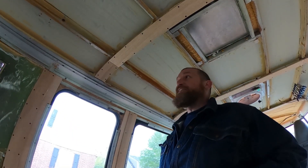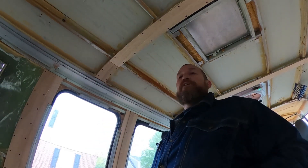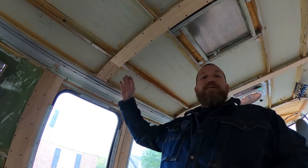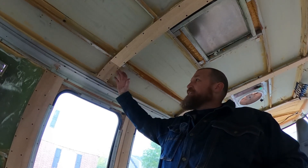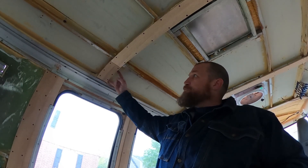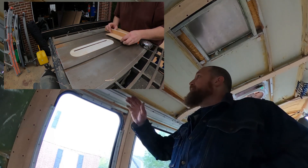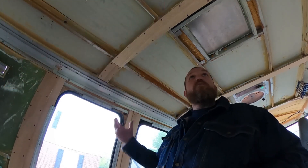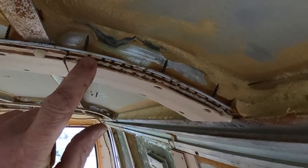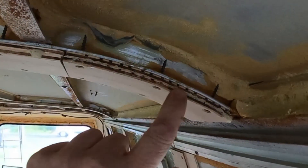Now the wood slats are done, we can go ahead and move on with the foam. But there are a couple things I wanted to show you. The top ribs I had to do just a little bit different — I made them in three pieces, because this bend here is a pretty tight radius for bending wood. So I cut these to seven-and-a-half-inch pieces and pie cut them, so the wood was a lot easier to bend. They screwed in and now they conform to the shape real nicely without a lot of pressure on the wood trying to open back up. You can see the little pie cuts I put in here to make the radius.